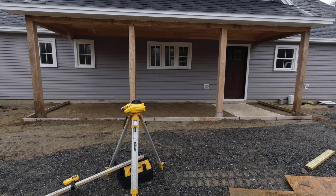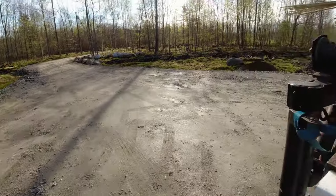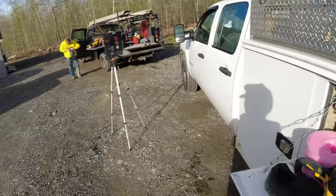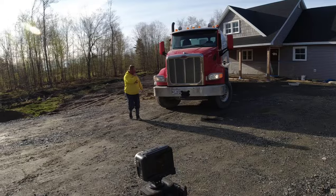Alright, so that's how we form a patio — that's about eight by 25. We'll tie the rebar in it, but right now people need to use the door to walk in and out, so we don't want them walking over the rebar. We'll get back to pour and stamp it, and we'll put the rebar in that day.